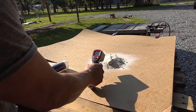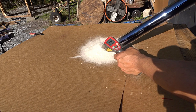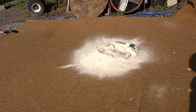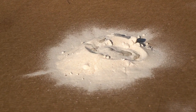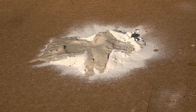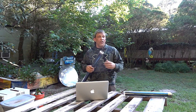First, the dry sand doesn't look hot right now, but that's 280 degrees — oh wow, 295. It's pretty impressive. Pour some water on there — just a little bit. So even though that sand doesn't look hot, you can see it has no problem instantly flash-boiling water. In the tests that I've done, the white beach sand inside — and just because it's white it usually reflects sunlight away, but it never sees sunlight, it's just touching the surface — it gets within 10 degrees Fahrenheit of what the metal fins do.